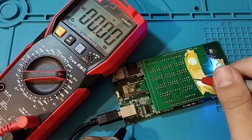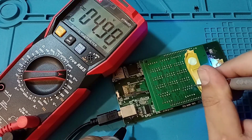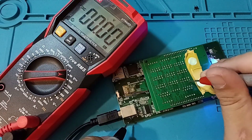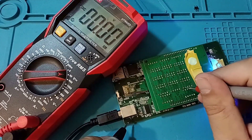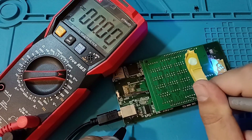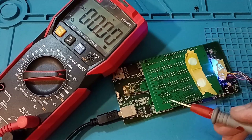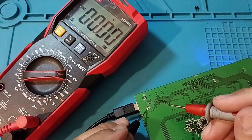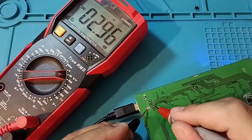And also this bad relay — let's measure the bad relay. You noticed it does have voltage, but it doesn't work. None of these pins have anything on this bad relay because it's dead. But for example we take this one and let's see if it has voltage — yes, this one has voltage. To another pin, this port also has voltage. On the back you should have ground, and you have 3 volts and 5 volts over here. Here is the 5 volts, here is nothing, and here is 3 volts from the PC.